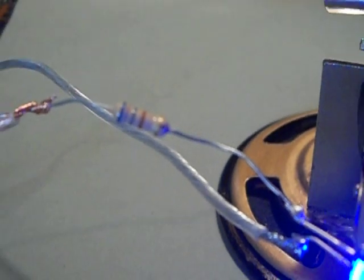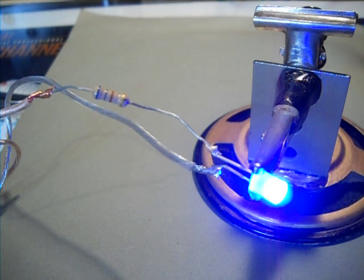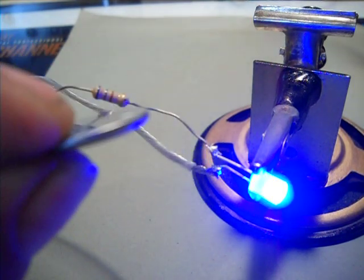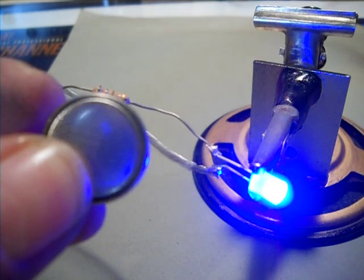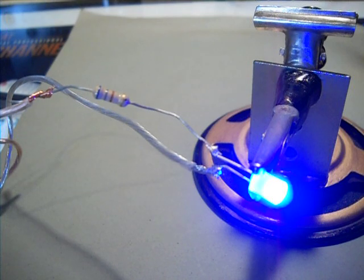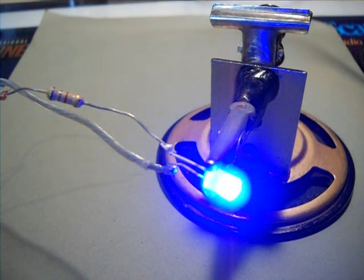Thanks for watching. Like I said, this has been on here over an hour and a half and it hasn't burned out yet. This was the brightest blue one. In my mind, I thought if it's the brightest one on the little button cell batteries I use for experimenting — that's in the other video — these little button cell batteries work great for testing the LEDs, just to see if they work. This is your ground side — opposite of what you think a battery would be. The one that's separated and the big outside cover is positive. Those are pretty cheap batteries — you may have to pay three dollars, I've seen them for a buck and a half on sale. They go on watches.